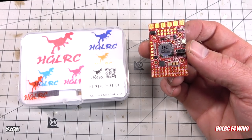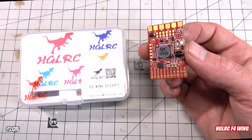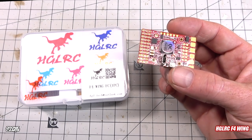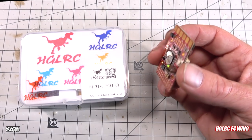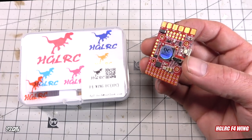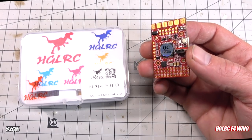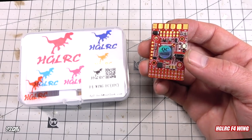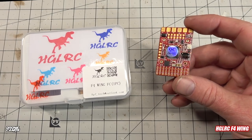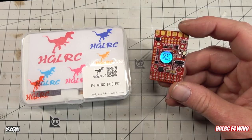You can add smart audio, get your GPS going, and it has a built-in compass with the GPS. Some of the other flight controllers I've used didn't have the compass. It also has five UART serial ports, so you can add more functionality — even a pitot tube on one of those UARTs to give you airspeed. It basically has a lot of options, so let me open up the box.